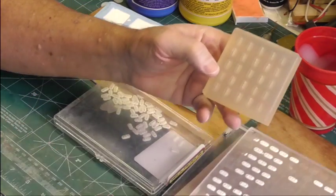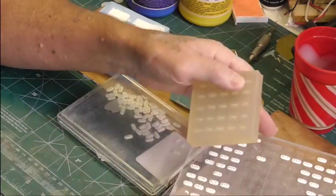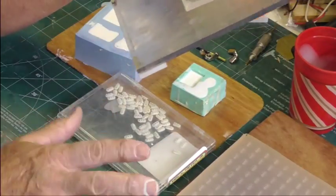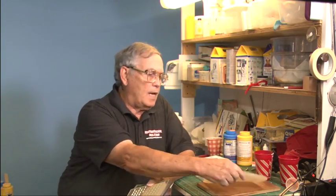They're not to be touched for a long time. If I need more, if I need to make a new master piece, I'll cast this, then make a new one and then a new production mold. Now why do I even have to think about that? Because the only thing we haven't talked about tonight is degradation. Degradation is when I do castings with urethane in silicone — the general rule is I'm going to get about 15, give or take three to maybe five at the most, parts out of this mold before it's going to begin to tear in some places or degrade. So I'm not going to get that many castings out. That's why I made 166 or whatever it is in here, because I knew I was only going to get about 15 shots out of that before I'd have to make another one. So I made a lot of them.